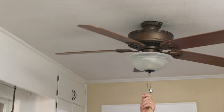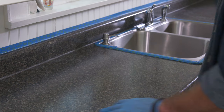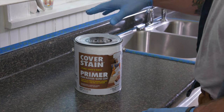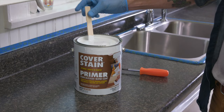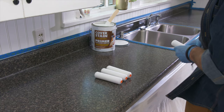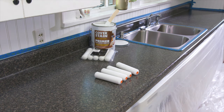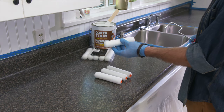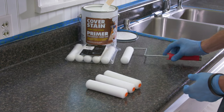Once your surface is fully prepared, turn on a kitchen fan or open a window. A smooth laminate countertop requires an acrylic primer intended for glossy surfaces. Make sure that your primer and paint are well mixed. It's a good idea to have more roller covers than you think you will need — purchase more than enough and return what you don't use. For smooth surfaces like countertops, a foam roller cover is recommended, as this ensures that the paint goes on smoothly.